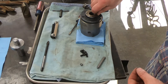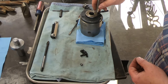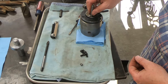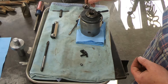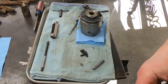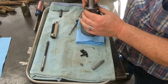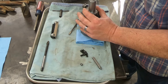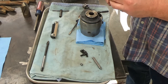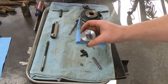Quarter by 20. If you guys don't have a set of these I highly recommend it — when you've got to locate a blind hole, these are handy, quick and dirty. All right, so just going to try to locate this in, and there you have it — some punched holes. Get this in the middle, locate them in.